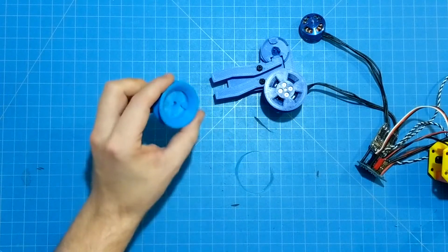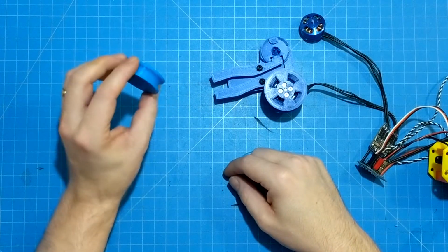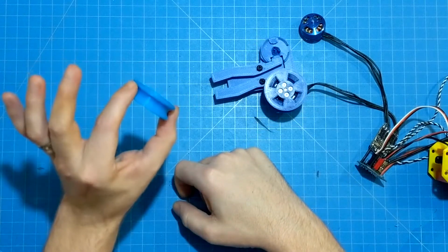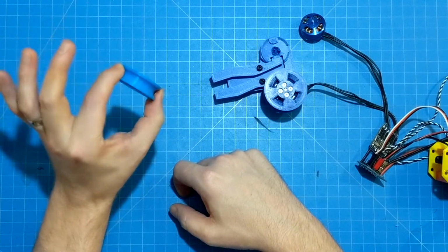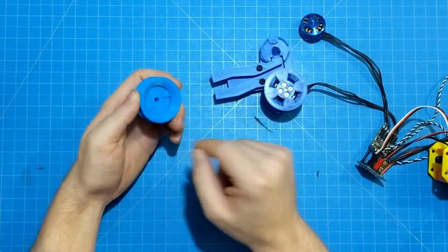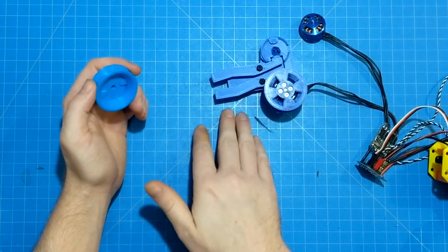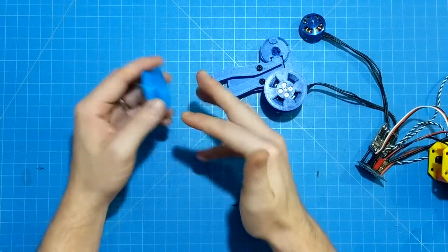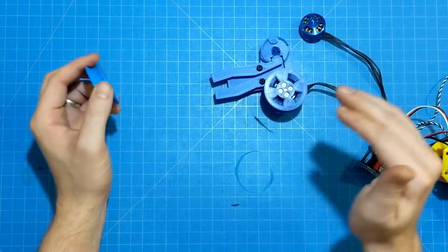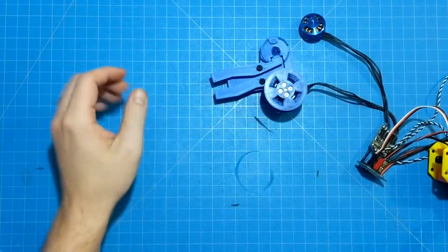There is a nice thing about this style that I forgot to mention: you can actually get a balancer where a shaft goes through the middle of the wheel, and you set it on there and it spins and drops the heavy side to the bottom. That's useful, and it works really well for propellers. My preferred method is what's called dynamic balancing. So rather than officially finding the weighted side of the wheel and cutting off of that, we're actually going to run it, and we're going to do it by feel and by ear.